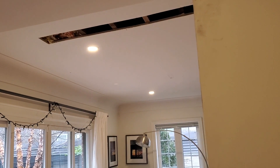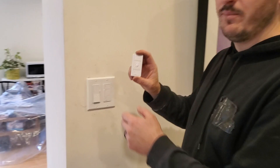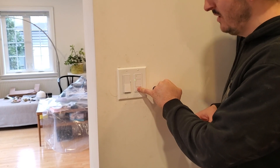And this is the remote that comes with it — it looks pretty much the same as the switch. I'm going to show you how to pair your dimmer. Again, Caseta Lutron — this is called the Pico remote. The lights are on right now and this is working. You're going to hold the off button for six seconds, until you see these little lights start flashing.